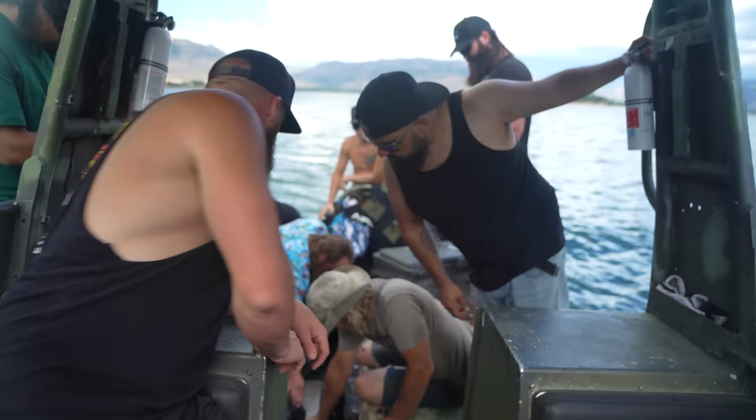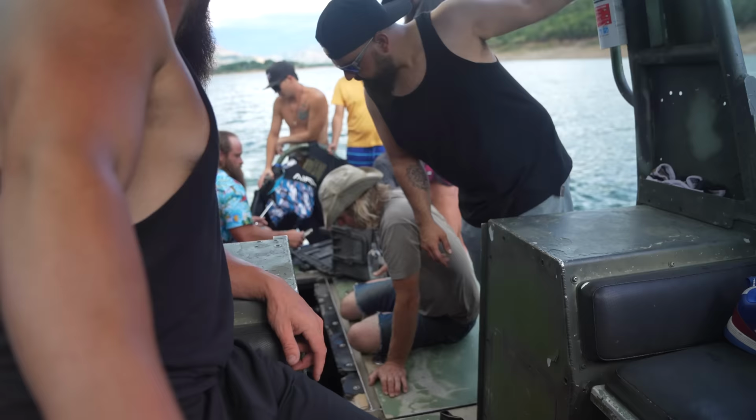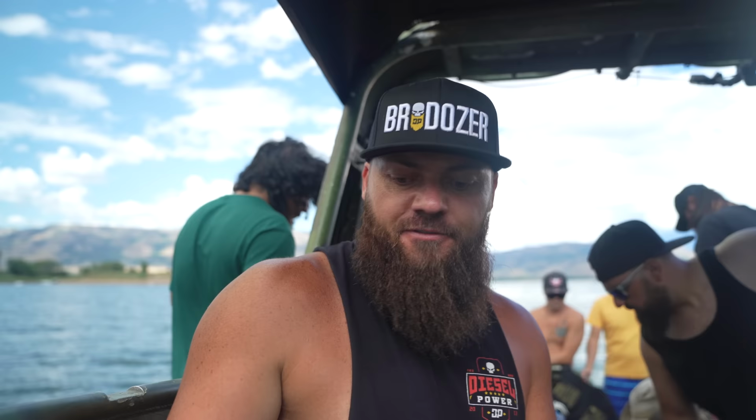So, the boat has an impeller on each engine that pulls fresh water in and runs it through the cooling system to keep things cool. And if the impeller's not working, either the impeller wasn't working, or the thermostat, or the coolant cap blew off. Anyways, it's got a way for me to open a valve that takes the jet stream out of the engine and runs it back into the engine to cool it down.